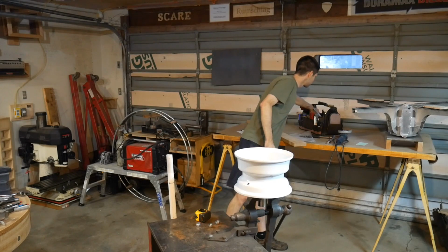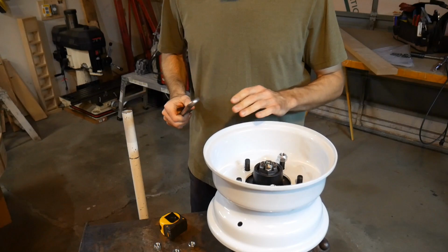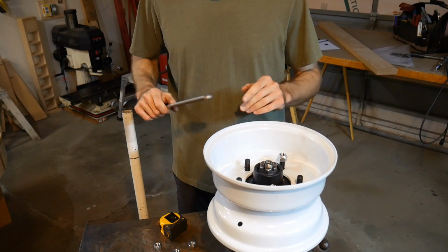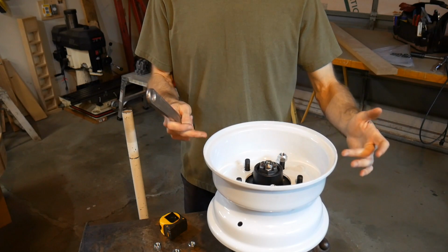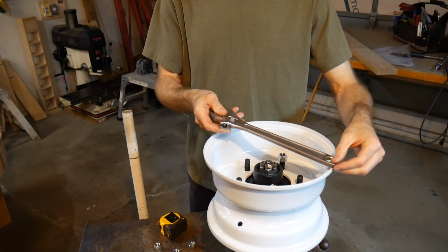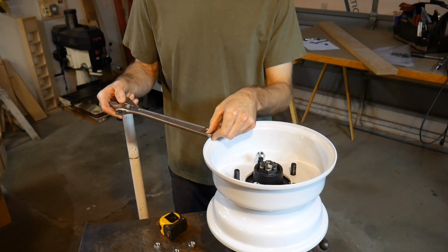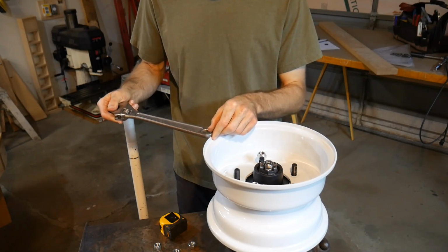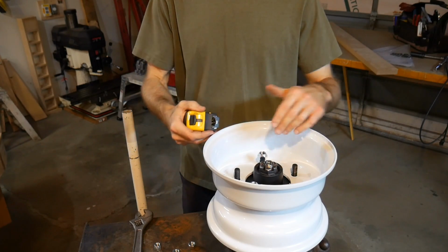We also end up with a little bit of a conundrum in terms of our ability to expand this table. The key point to keep in mind in terms of the expansion ratio is that if you were to use an arm system, your maximum expansion is the diameter of where those arms are mounted. So if this is the arm which is going to push it out and it's mounted here, this from here to here is the maximum expansion that it can offer, because it came from this side over to here.